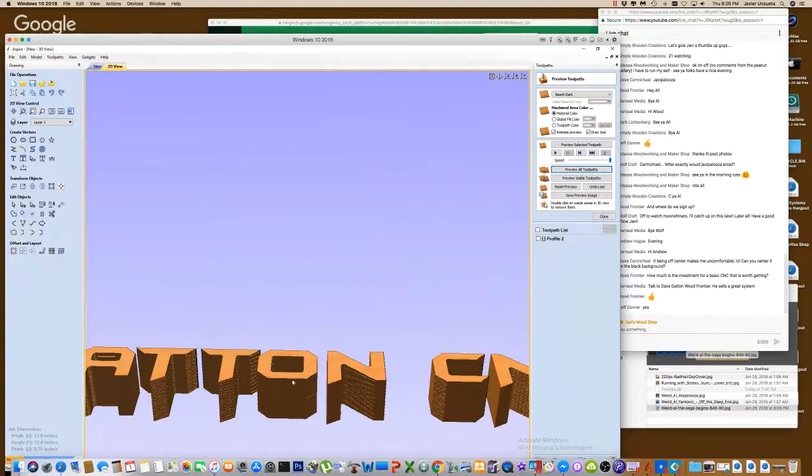If you start with a downcut bit, it pushes all the sawdust down. Since it's cutting downward, it's not going to pull any of this edge up. It's going to create a clean cut along the top. However, when you get to the bottom, unless you have a spoil board glued onto the bottom and then sand it away, you can't get a clean cut on the bottom, because it'll push the small pieces of ply, the veneer of the plywood, down.